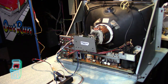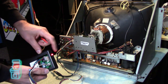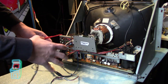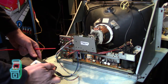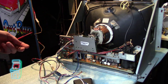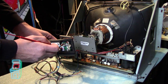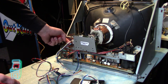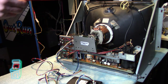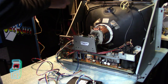We're back. I have my test pattern generator here — mine is modded with an LED indicator so I know when it's still on and won't kill the battery. I'm going to turn that off for now. I have it plugged in but I'm not sure on the pinout. The cool thing about this TPG is you can set the dip switch settings to adjust sync. But first, since I changed the B+ cap, I definitely have to adjust the B+ voltage.